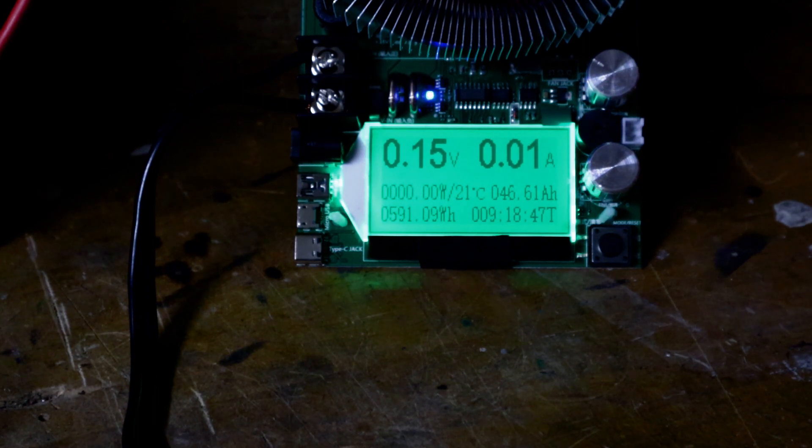After 9 hours and 18 minutes, we've depleted the capacity of this BioAno Power 50 amp hour battery. It's at a 0% state of charge and we received 46.6 amp hours. This is the fifth time I've run a full capacity test, and in the previous four I've gotten anywhere between 46.6 and 47.7 amp hours. So this battery is supplying around 93 to 94.5% of its rated capacity, which is pretty typical. They do reserve a little power for the BMS, which still needs power to manage the recharge cycle.